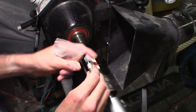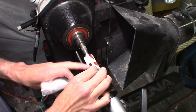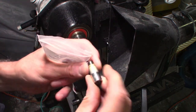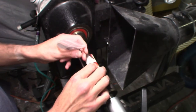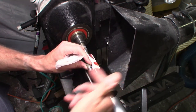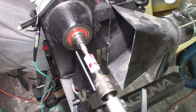It's a little bit more accurate to use TBC bushings for the kit that you're doing. That's just one component, then you've got it between centers. Adding this on adds a tiny amount of less precision, but it's still way more precise, as far as wobble and runout, than using a mandrel. That way you don't have to buy a ton of TBC bushings, because they're not necessarily cheap. If you already have bushings for everything, you can just buy a set of these adapters and not have to replace all your bushings.